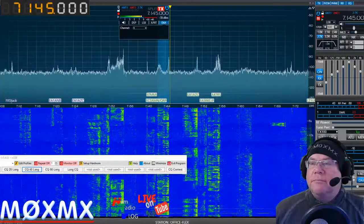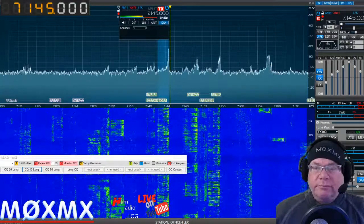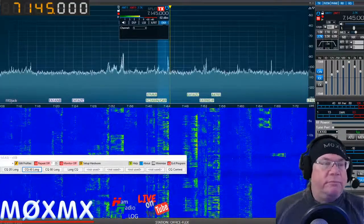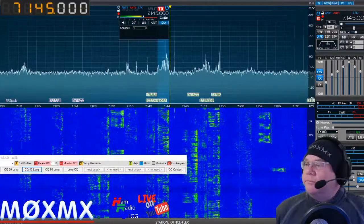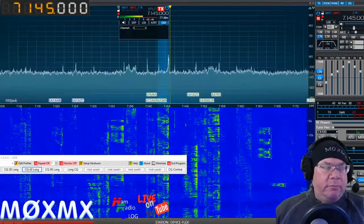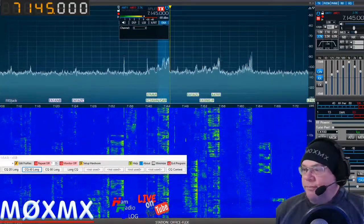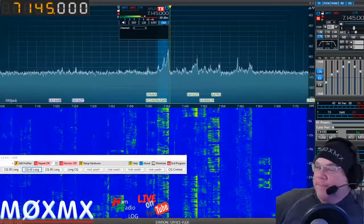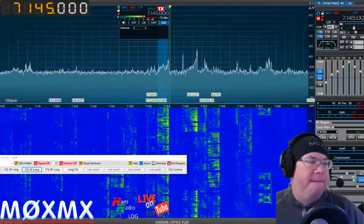But okay, you mentioned your dipole. Is that a trap dipole, a 40/80 trap dipole? Is it traps, or is it just... maybe it's not a G5RV by the sound of things, it's a dipole, but I don't know if you've trapped it to give it the 40/80. I have an 80-meter wire dipole on the same feed as my Comet 8422, and that one works a real treat. I did notice with this antenna that over the duration of -5 in snow, my SWR went up a little bit. But anyway, it's back down to normal now. I'll put it back to you, then I'll let you put some more calls out, Mike.